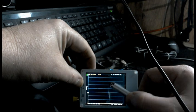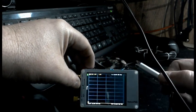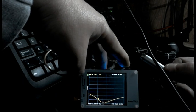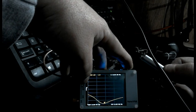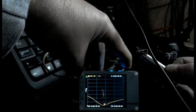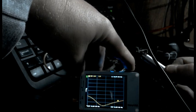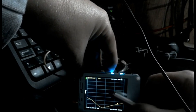18 megahertz — 18.2. That's the CW part, that's 1.9. Packet and FT8 — we're in the phone section now, so that's 18.1 megahertz, and we're on an SWR of 1.1 to 1.5 going out of the band. 1.8, 1.7 — it's creeping up, but it hasn't gone above 3, so that's totally workable. Success. I'll be adding 40 metres tomorrow. Thanks for watching.